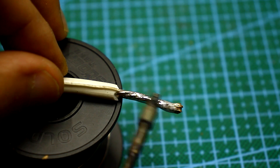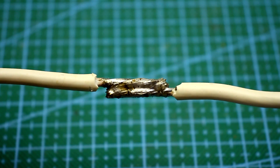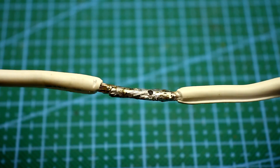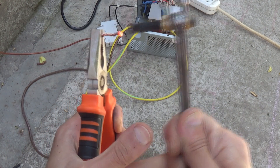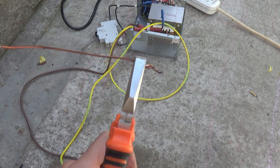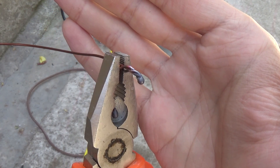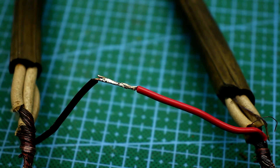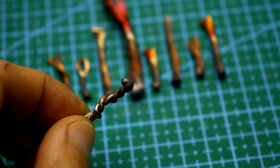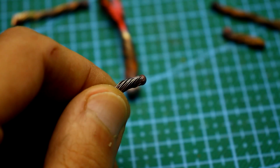The device is specific, designed for welding twisted wires with a carbon electrode. Why do we need it? The main and most popular way to connect wires is soldering with solder. But solder isn't eternal, and when we need a durable mounting, welding of wires is more reliable. Welding is literally eternal. The advantage is that there will be no additional losses at the welding point — it is like a solid wire. In the case of soldering under large currents, the solder may even melt. But before welding, the wires are twisted together and welded, and a drop formed at the welding point is a typical characteristic of this method.